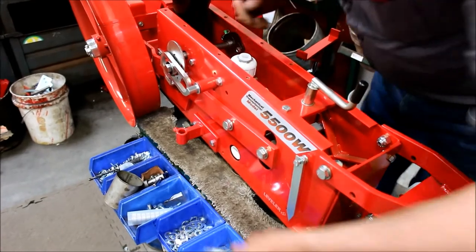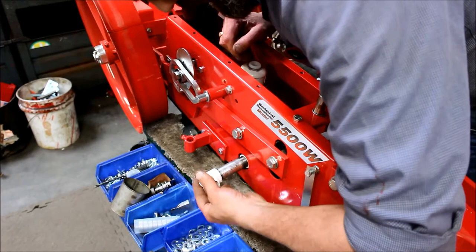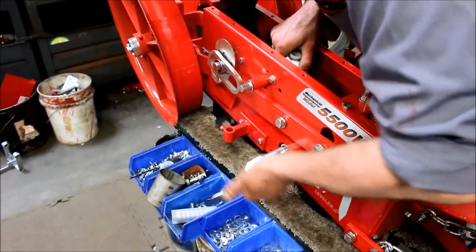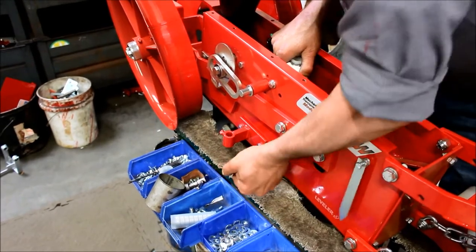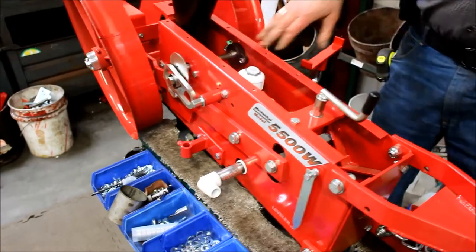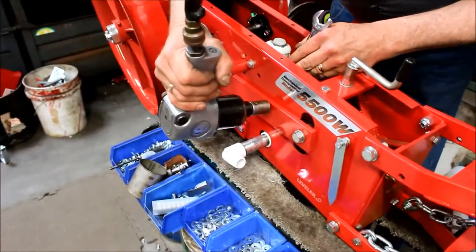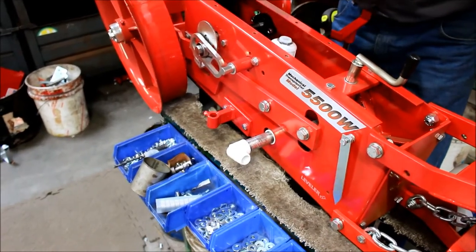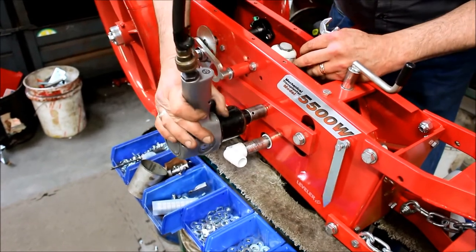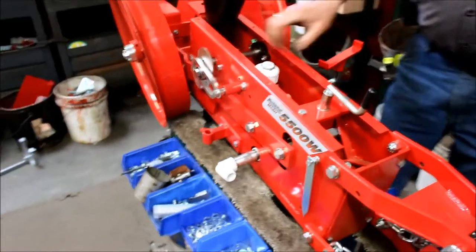Make sure that your outlet is in line with the hole in the side of the frame, and you can install your valve fitting, to be finished tightened later. Tighten the water valve up in the frame. Water valve is mounted.